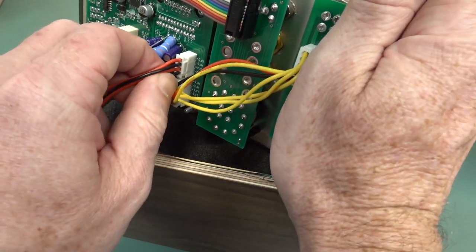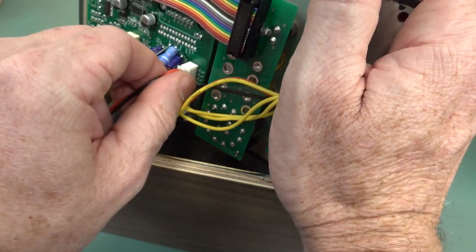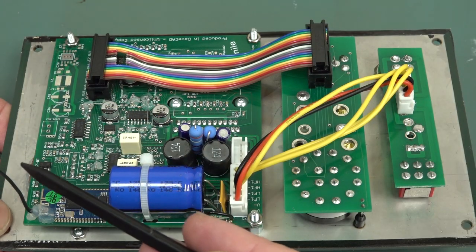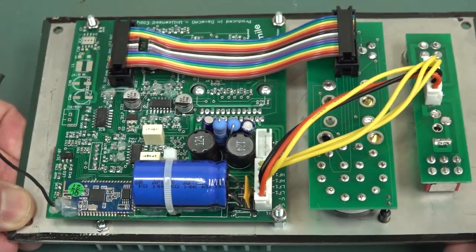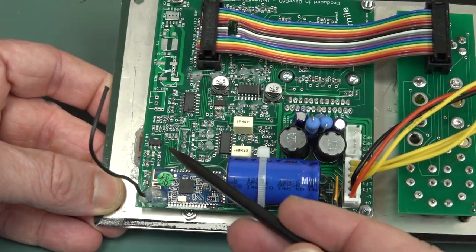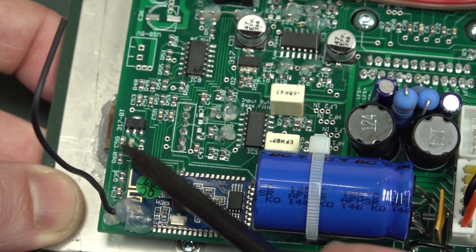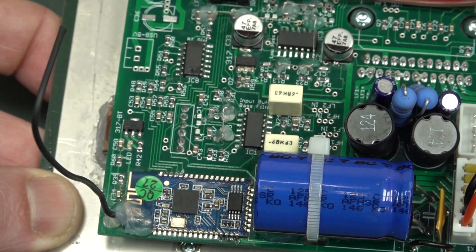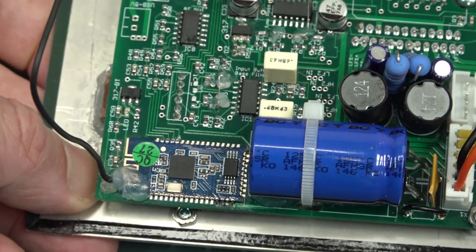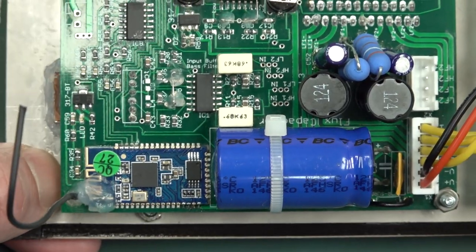So we've got green solder mask, black rubbish. Oh, there are silicone leads too. Very nice. So there's our Bluetooth module with a Bluetooth antenna just flapping around in the breeze there. But yeah, you can actually disable it. Is that a MOSFET to disable the power? That'd be a regulator, sorry. Local regulator powering that, separating it, because you don't want that Bluetooth rubbish. Seriously, if you want Bluetooth, just go and buy a cheap pair of Bluetooth speakers. But everyone's got different requirements, okay.